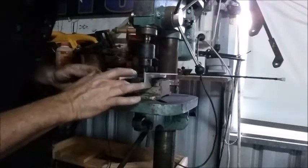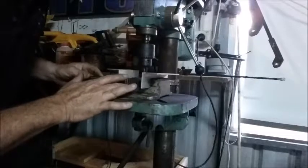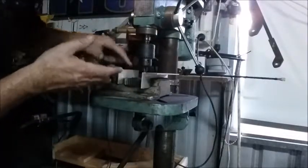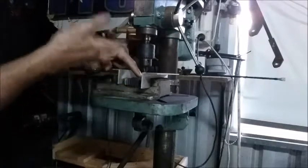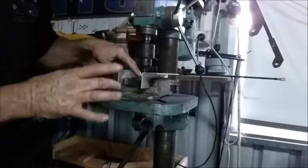I decided against the timber, we'll just put him straight on the plate. That way we can lift the base up, and we can actually use the top part of the tip instead of just chewing out the bottom edge of the tip, so we can use the whole tip over both the jobs on all the gears, and then we're not wearing our tip out on one spot.